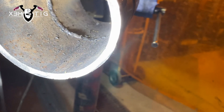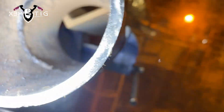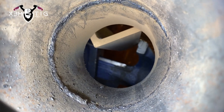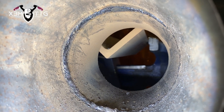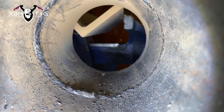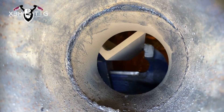This was only an experiment to see how it reacts and what we'd accomplish. Comparing both sides: on your left is the pre-soaked 6010, and on the right is the dry one we did at the beginning. I definitely feel the arc becomes more penetrative with the pre-soaked rod, and arc blow is lessened — it gives you better control. Hope you enjoyed the video, learned something new — go ahead and try it. Thanks for watching and see you in the next one.